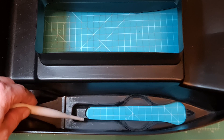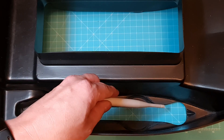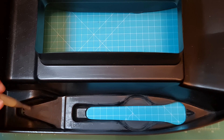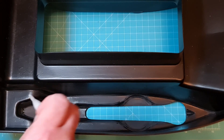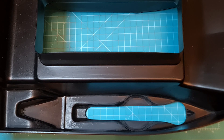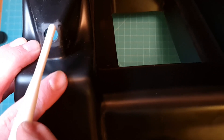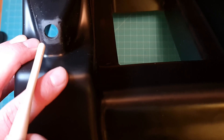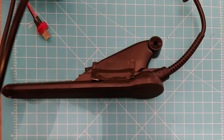When the hole is completed I prepare the boat for mounting the gear. I've sanded down the area where I will glue in the motor holders. I also sanded around the edges where the transducer is going to be glued in, and behind I also sanded around the area where the glue fitting will hold the shank. I also sanded around the edges where the bolts holding the weed guards come in, and even sanded outside where the shank will come through the hole. I'm really thorough here because water leakage in the underhull is catastrophic.